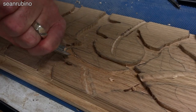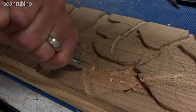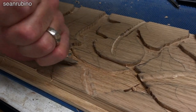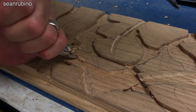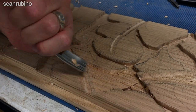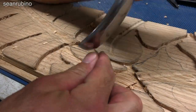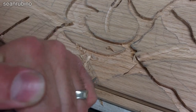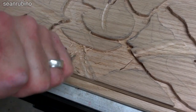I felt like carving a fold in the tip of a leaf to give a little more detail. I'm not an experienced carver, so I tried my best to carve with the grain to avoid tear out. My goal was to be able to finish the panels without needing to sand, so sharp tools and good grain reading was important. I tried a few different tools to carve this detail. I wanted there to be some undercutting, so I used some conical burrs in the rotary tool, but that was not long lasting, so I stuck with the hand tools and settled for a less is more approach.